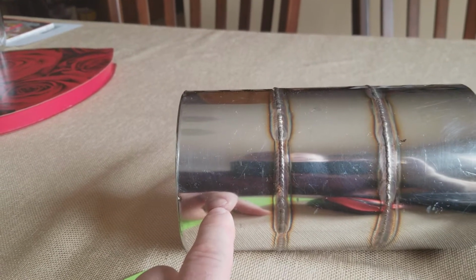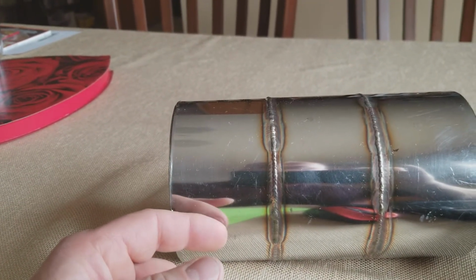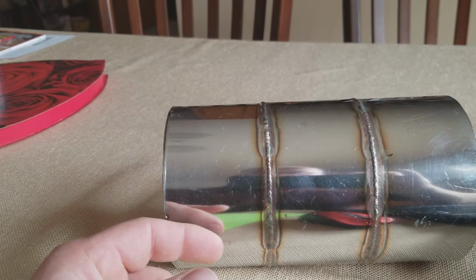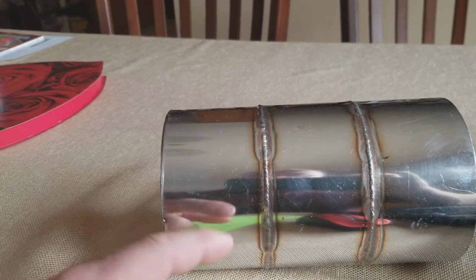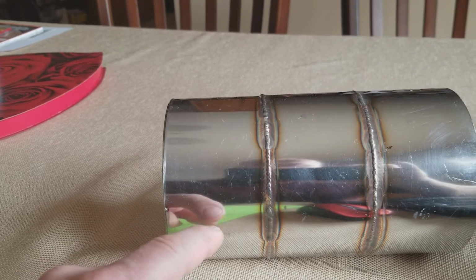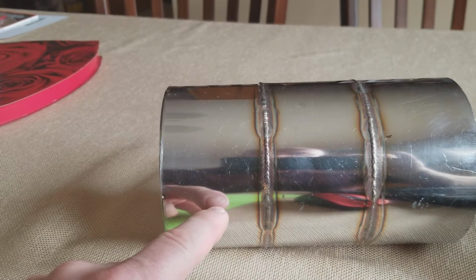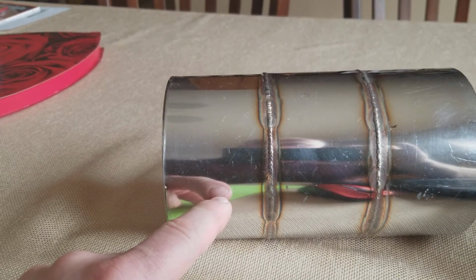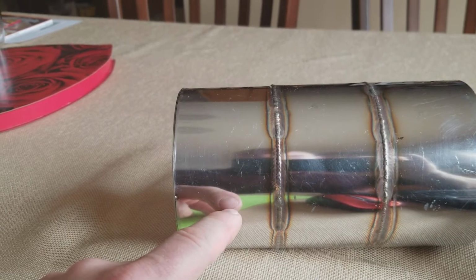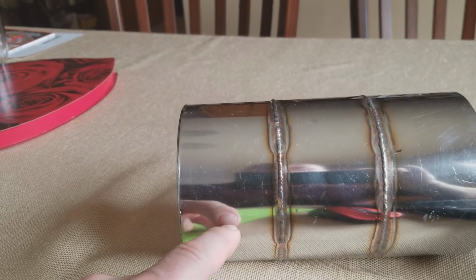So I brought it right here, and I basically used a piece of paper and kept cranking the cutter in until the paper wouldn't move. Then I backed the cutter off just a little bit, pulled the paper out, and then I started manually spinning the tool until I saw a very slight chip. Okay, then once I saw the chip, I called this 9 o'clock location Z0, Y0.